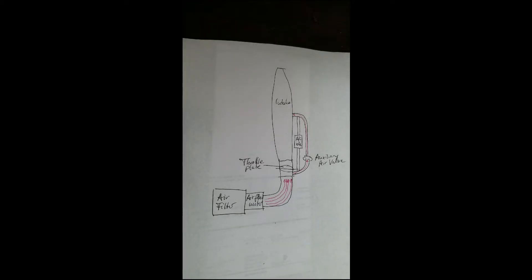And that is just to help cold start. The difference is with a broken auxiliary air valve an engine will cough and sputter to life, and with an intact auxiliary air valve it will come on and run immediately.